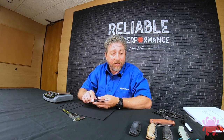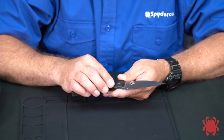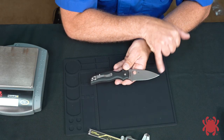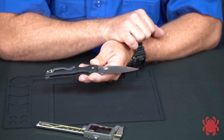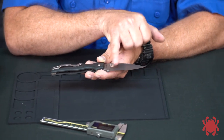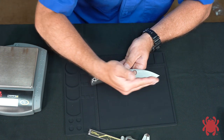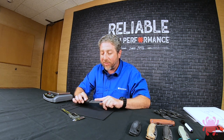Also, with this edge angle, we shoot for 17 degrees. We're typically within one edge degree angle, and you can see even as the blade gets thicker, we're able to keep that nice consistent edge. Also, we really pay attention to not over plunging at the back of this edge. Oftentimes you can over sharpen, particularly when you don't have a choil, and you get kind of a reverse S curve in there. And so this gets a nice flat edge into the curve of the tip and drawn all the way out to a nice crisp tip.